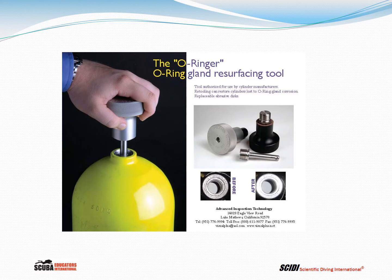And here we're talking mainly about aluminum cylinders, because on steel cylinders, that surface is tapered and usually doesn't have an issue. But on the aluminum cylinders, if the land or gland has deposits on it, it's not really corroded, but you can clean it up. This O-ringer tool that most dive shops have has a little ring of sandpaper right there, and the operator simply turns the handle and sands the surface to make it nice and smooth.